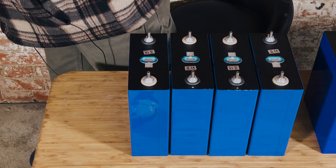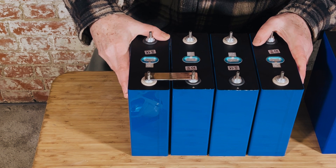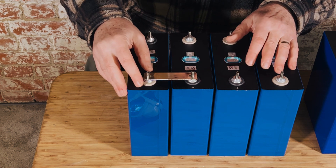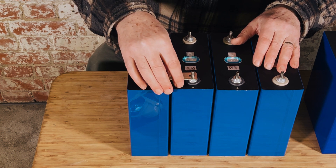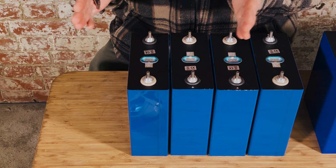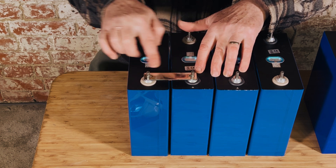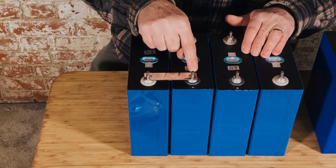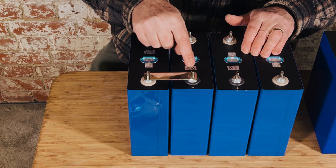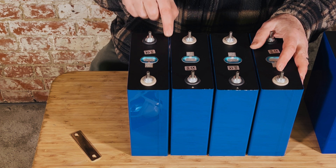Your problem with a bus bar here is that it's already taken close to its limit. You're going to have to tighten the bus bars down when the cells are fully expanded so you're not putting incredible pressure on the terminals. If you put the bus bars on when the cells are totally discharged and not swollen, then tighten them down and charge them up, the swelling will put enormous pressure on the bus bar, which gets transmitted to the terminal internally — and you're going to get breakage, things cracking and moving about inside. So I'm not overly impressed with the amount these have swollen; I would never use these in an RV, van, boat, or anything like that.